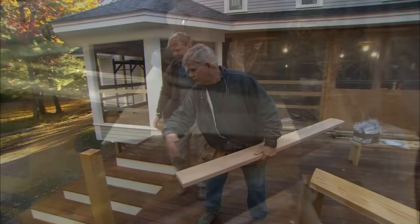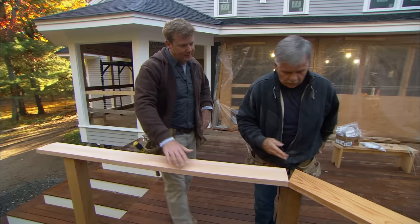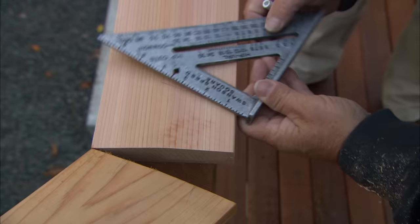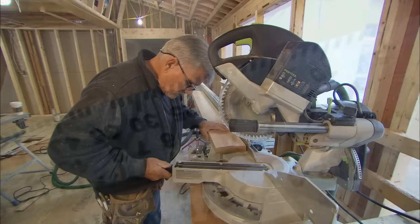Now this one we have to bisect the angle. I'm going to line this edge up right here with this railing and center it on that post. The easiest way to get this angle is to take a scrap piece of wood, make sure it's parallel, and lay it on top. Line up the miter right here and draw a line — you're just transferring a parallel line over. Then I take my speed square and read that angle, which is 21 degrees. I'll set my saw and cut it.